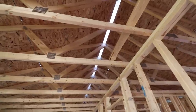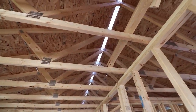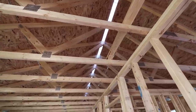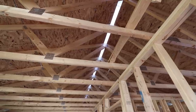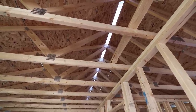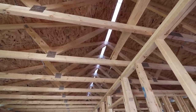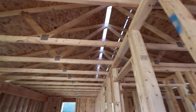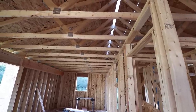Well, if we get a 2-foot snowfall, and for sure this winter there's going to be 2 feet of snow up on top of there, you're thinking that warm air, because always some warm air will bleed up into the rafters, well, when the warm air hits snow, it kind of turns to ice. And to me, it seems like the air wouldn't be able to flow very well, even through heavy, wet, packed snow. But anyway, it's legal. So I still think I'm going to put vents on the end of each gable end to help air things out.